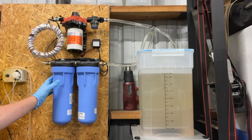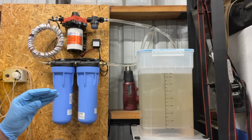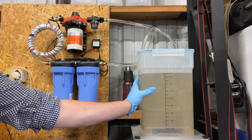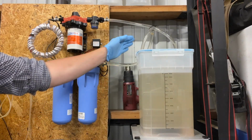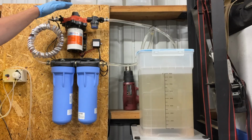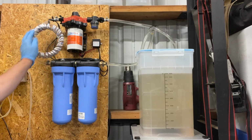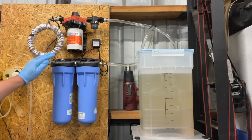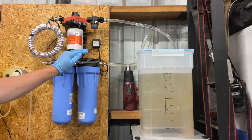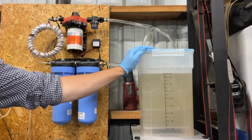This is the IPA filtration system that I've created. The parts consist of a basin to put your prints in to wash them after you've printed, some vinyl tubing to connect to a pump, some more vinyl tubing to go through this little reactor here, and then two particulate filters that go from 5 micron down to 0.5 micron here, and then back into your receptacle.